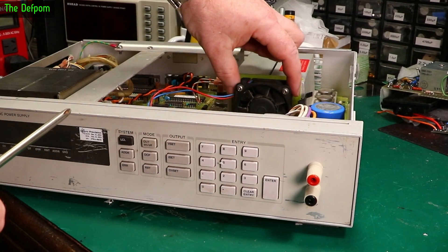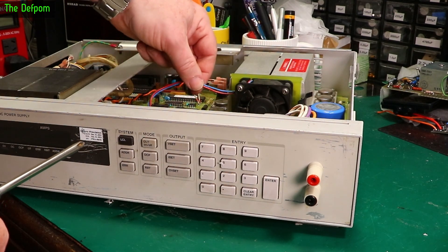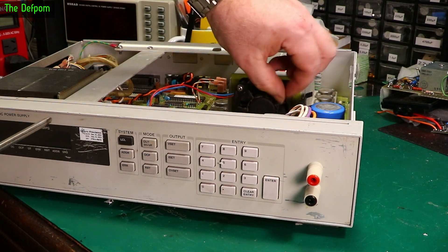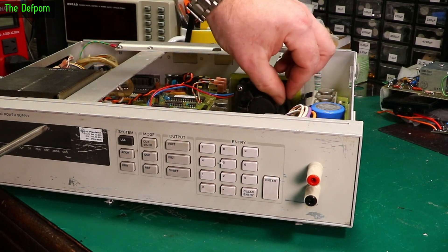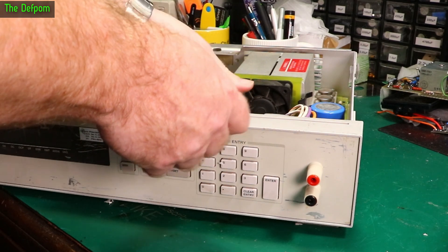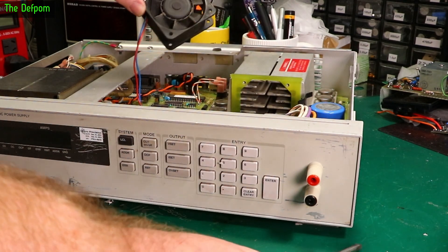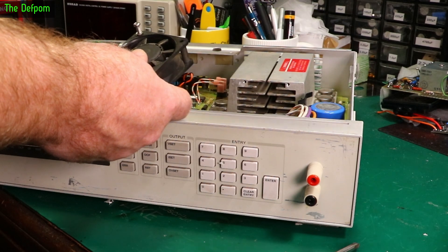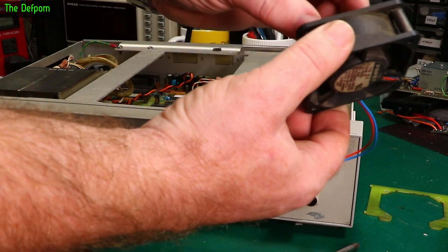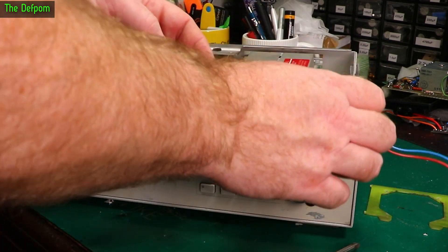Got to do something about the fan. So I just went to go and release this fan to have a look at it and see if I can make it quieter — oil it or something. I only found this screw here is actually loose already — I guess vibrations done it, I barely had to touch it, it's just turning. That was really loose. This one's slightly tighter but not much — and then it has two screws holding it on, and a PCB baffle just to guide the airflow. 12 volt fan. That feels rough actually — it's got a bit of play in the bearing and it feels rough. I can feel a vibration. So yeah, that could use replacing — let's see if we can find one.